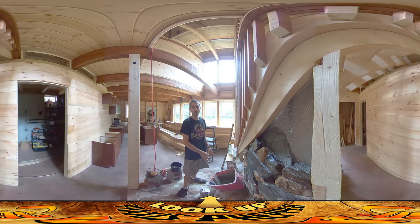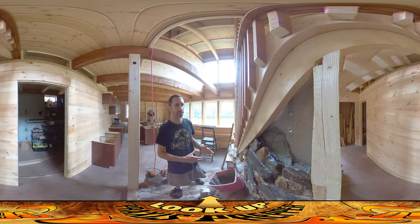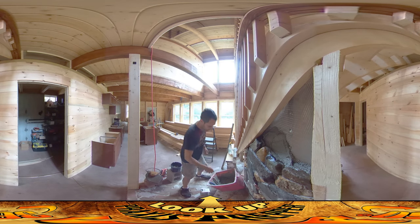The first thing is that the mortar mix I'm using is a Type S mortar mix, used for stucco, but I add a dash of Portland cement — maybe a ratio of about 15 to 1, 15 parts Type S mortar with one part Portland. The Portland cement gives it a little bit more strength and more resistance to chipping out later on. I mix that up in small batches.